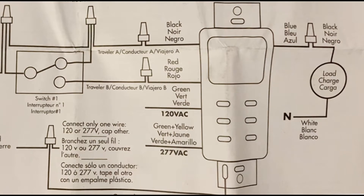On the schematic, you can see the hot black wire coming in, providing power to the switch. When the switch turns on, the blue wire is energized and sends power to the load — whether it's a light fixture or a small motor. Notably, this switch does not require a neutral wire, which is nice.